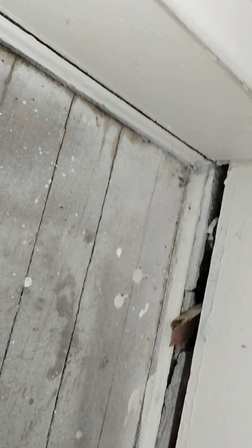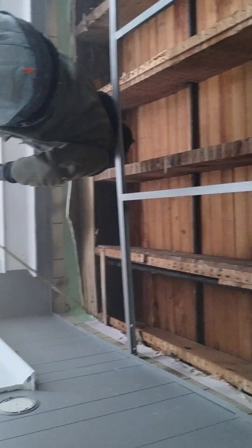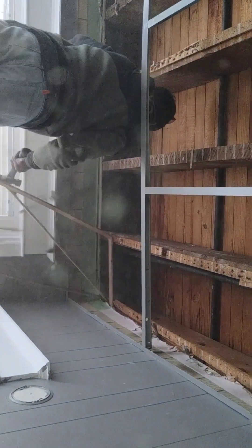He's right below me now, so we're going to see if we can identify that dip — not by tearing up the floor but by going the other direction. He's right below us, exposing it. You can see no cracks in the floor joists, they're not twisted too badly, no blocking, no crazy notching. The notching is fair. There's a water stain — the bathroom's over there.